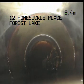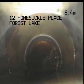Okay, so I've done a location as best I can. We're approximately 2 metres to the left of the right-hand boundary fence. We are either 500 millimetres from that rear fence, or we're right directly below that rear fence, possibly even going out the back. I jumped over the fence and located further. I seem to be getting the strongest signal, as far as I can tell, from the fence line itself. Now, I've cleared this blockage as best I can. I've worked it with the jet. It's at a depth of approximately 2.1 metres, so it's very deep, being the council connection.